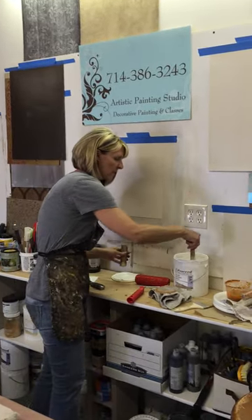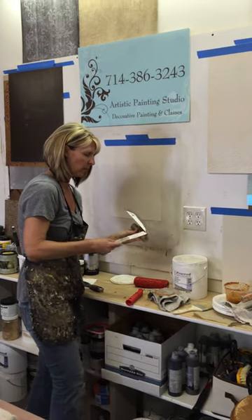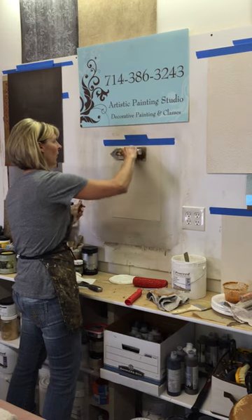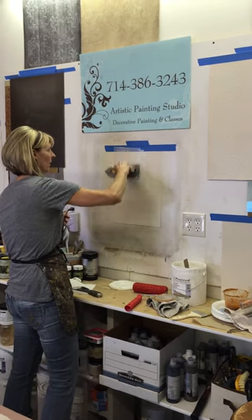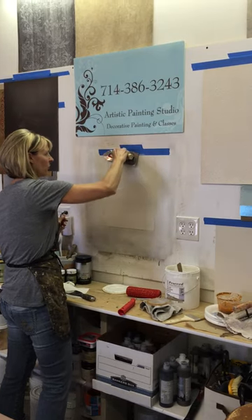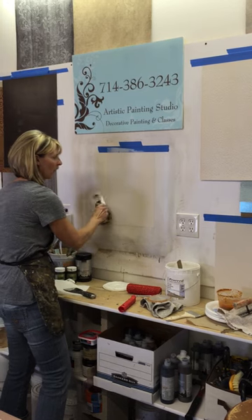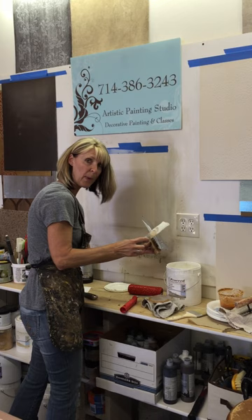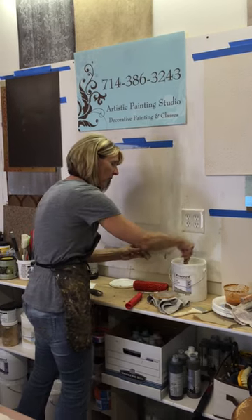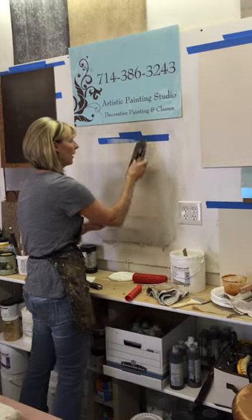Starting off with Proceeds material, smooth absorbent texture, and I'm just going to put some on my trowel and trowel the product onto a sample wall here. When you're troweling this on, you just need a thin layer of material. You only need enough for the roller to be able to create the print or the pattern that you're looking for. You don't need to have it on really thick so it doesn't take a whole lot of product.